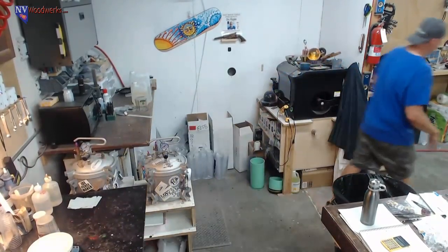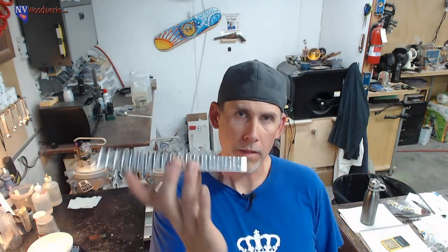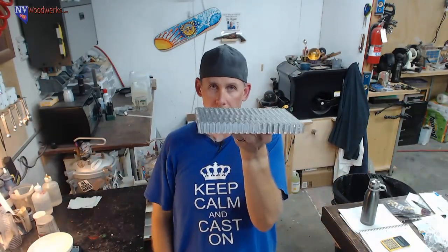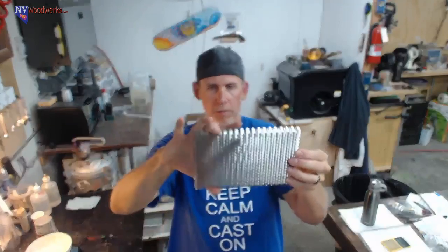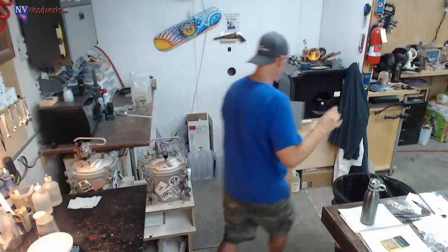How do I cut the honeycomb? So, aluminum honeycomb sheets. I want to show you guys one thing since this question got brought up. I have a video on my channel, but it's pretty simple, not much to it. Just use a bandsaw. I think I'm using something like a 14 tooth per inch blade. The big thing is you want the honeycomb to sit flat on the table. Do not try to resaw it, cutting it this way. It'll just crumple because there's no strength. All of the strength in this stuff is this way. So very simple, nothing to it.